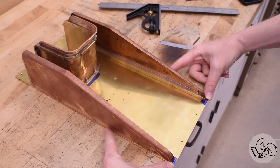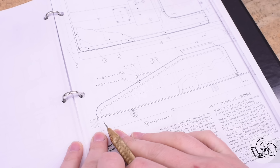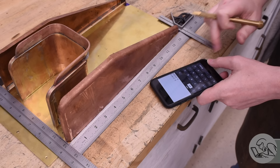So to the drawings, and let's figure out if that's the case. But no, as you can see, there's clearly a gap at the end of the floor pan that's supposed to be there. That's shown on multiple drawings, and I did some math — that is in fact supposed to be 3/16ths. So the back of my tender sides are in the correct location. That is not my problem. The next most likely explanation then is that the tender sides are too long. Let's double check that measurement. I'm doing all this with scales because I don't have any calipers large enough to take these kinds of measurements, but this is sufficient for what we're trying to detect here error-wise.